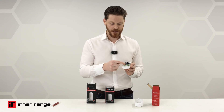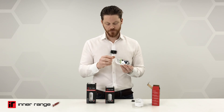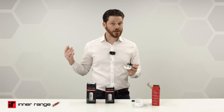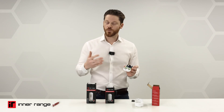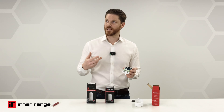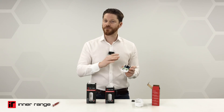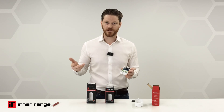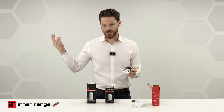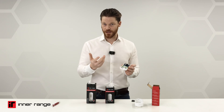You can wire a fifth wire into the LED control option. You have two options for controlling the LED: the jumper setting as a permanent setting, or the remote LED. The remote LED is particularly useful in public settings where lots of people move through during the day — you don't want the LED triggering and being visible, because that's information that someone trying to penetrate the building could use to scope out blind spots. But there are instances such as a walk test every six months or year where you want the LED on, without climbing up to each PIR to change dip switch settings. The remote LED lets you control that from Integrity or Inception via an output relay.